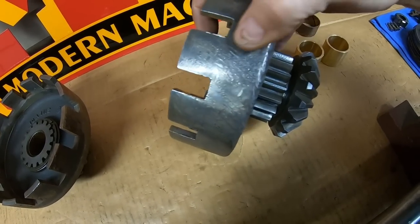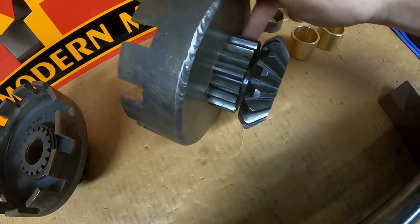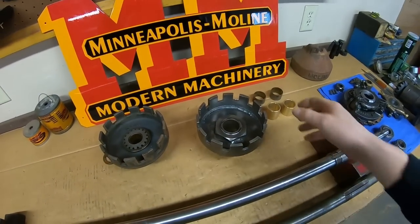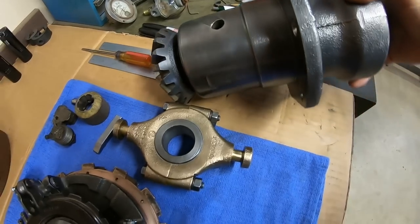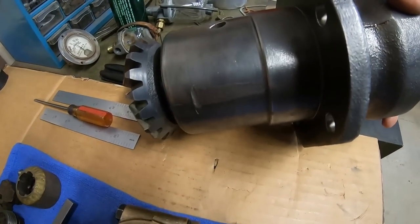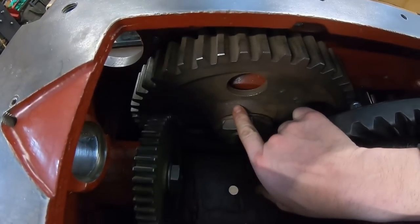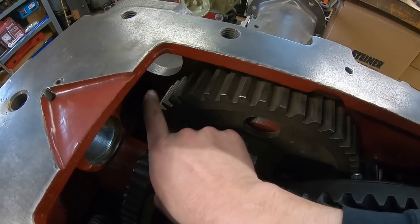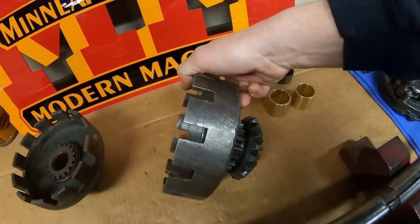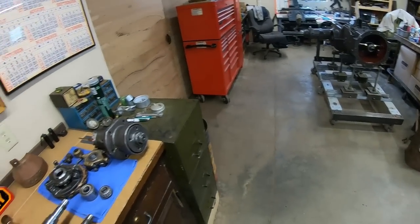The outside is a different story. We can see all of these angled scratches going all the way around. At first I didn't pay much attention because this was just such a rough unit, but they're so consistent. What clued me in was this gouge mark on the bottom forward portion of that belt pulley drive. I believe that mark and those scratches were caused by an axle bearing failure back here at one time. That would have allowed the bull gear to drop and move back - just another instance of the really hard life that poor old X231 had in its past.